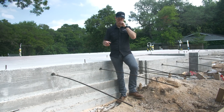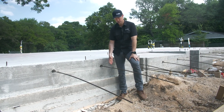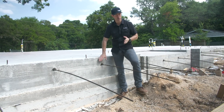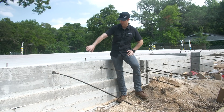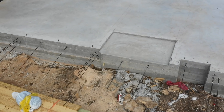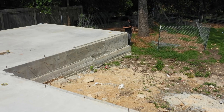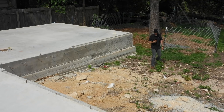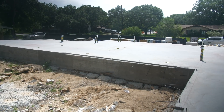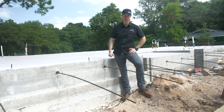One way you can tell if you're looking at an older slab — whether it's a rebar slab or a tension slab — is to look for these telltale circles. After they tension these cables, they're going to cut them, put an anchor post there, grout that in, and they might come back with a parge coat or stucco coat just to clean up the foundation formwork. But if you came back and looked at this 20 or 30 years from now, you're probably going to see these telltale circles on 36 or 48-inch centers around the outside of the house. You'll see this at the easiest access point — the front of the house — that's where they've run the tension cables on this front and on this side.